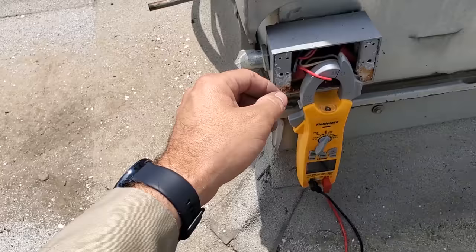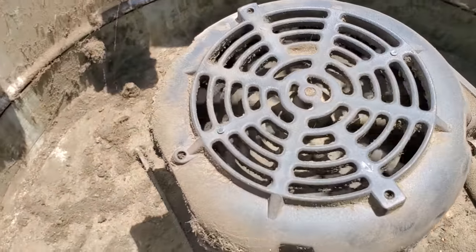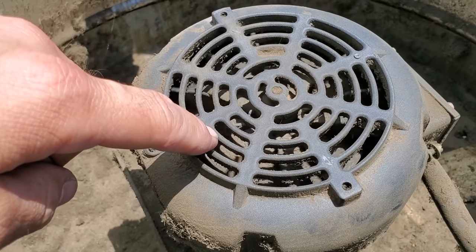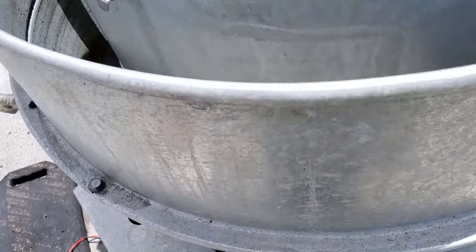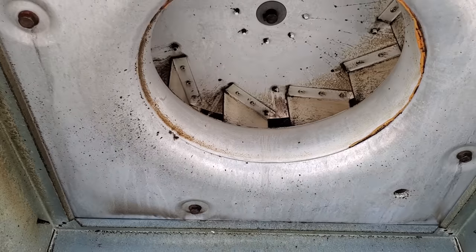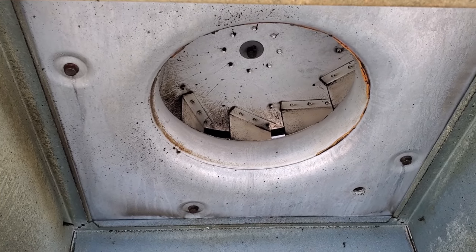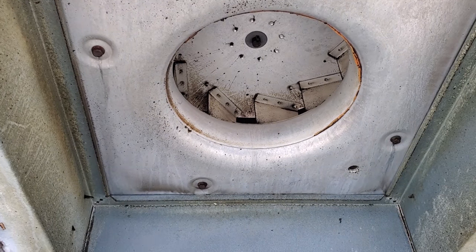What I notice is when I power it down, this is wobbling — like the shaft is bent or the blower is bent. It's come all the way up the shaft of the motor and I can see the whole fan assembly wobbling inside the motor. This thing has hinges so I should be able to get a bottom look at the wheel. Here's the underside — I don't see anything stuck in the wheel, it doesn't look abnormally dirty. So we just have an out-of-balance blower wheel or shaft. But I can guarantee this customer is not going to repair this — they're going to replace the fan.